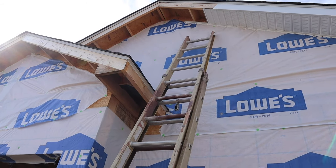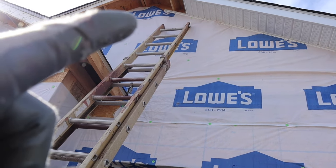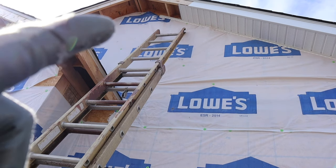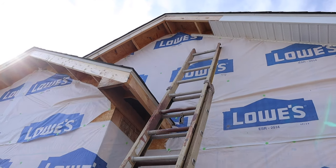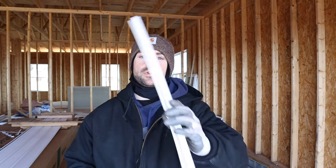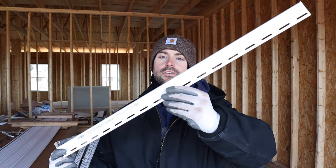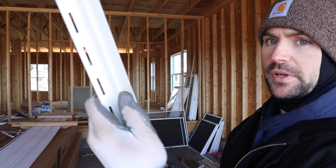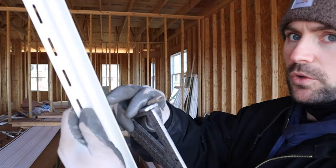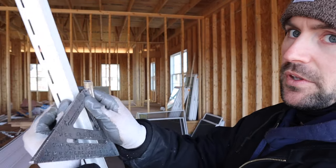This is the peak of the roof we're going to be working in. We still need to finish the F-channel. I already have the measurements: this piece is 17 and a quarter and this piece is 74 and three quarters. I have a piece of F-channel here — you want to make sure your factory edge is butting up against the other factory edge of the existing F-channel. Pull to 17 and a quarter, which is the distance we need from factory edge.